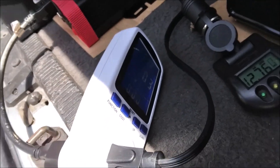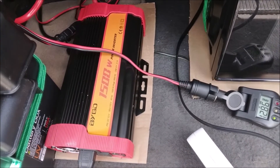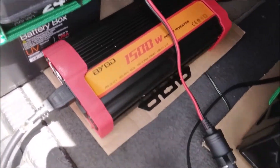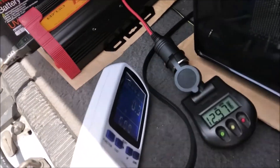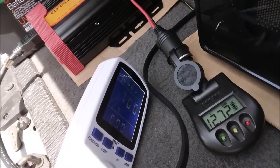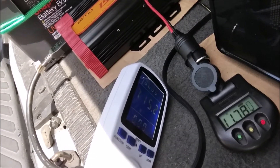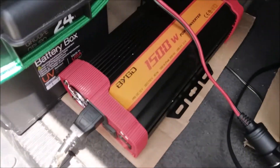I can pretty much run anything now — the only thing I don't think I can run is a washer and dryer. A 1000-watt inverter will probably work. I did not see this spike anywhere near a thousand watts — there wasn't some big jump. Testing one more time: yeah, not even close to a thousand. A 1000-watt inverter will probably work; I could have saved thirty dollars.